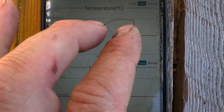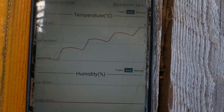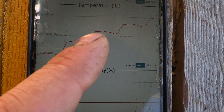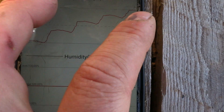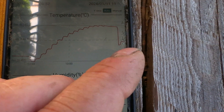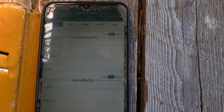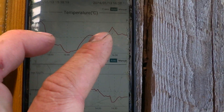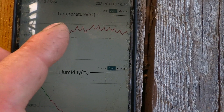Here are the alternations. If I zoom in — this is in the water storage tank — you can see when it switches over you get a boost, then it flattens out until it switches over and you get another boost. That's sort of how that works. If I didn't have the changeover, it would just be down here somewhere and wouldn't be as hot. So if we look in the booster currently — today you can see it alternates. It warms up on the booster, the water flows out, the booster cools down, then warms up, cools down, and so on.